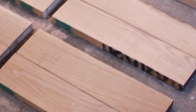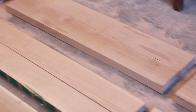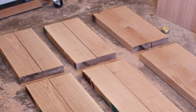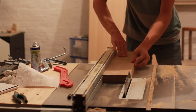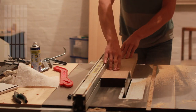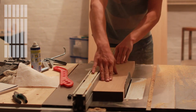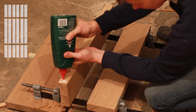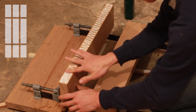This is important because I didn't want to remove much material from the four-foot boards, otherwise there'd be a noticeable difference between the grain on the main section of the table and the grain on the leaves. Once they were planed I cut both edges square and parallel at the table saw, removing as little material as possible. Having removed the bare minimum from all boards to get the edges square, I ended up with a final width of 802mm — only 2mm to spare.